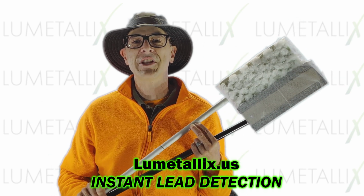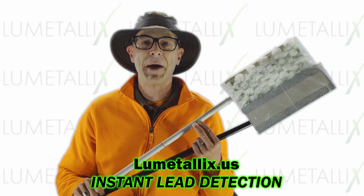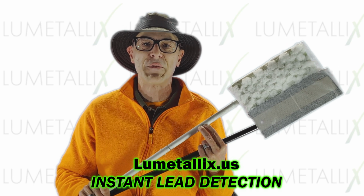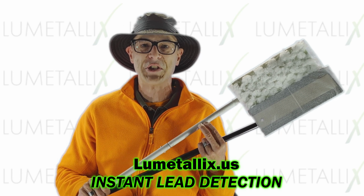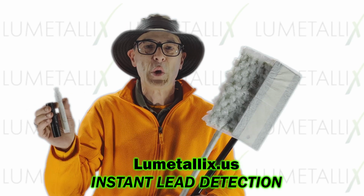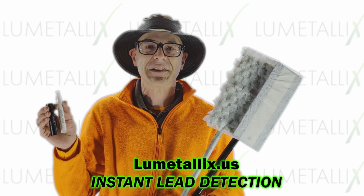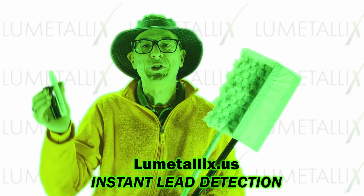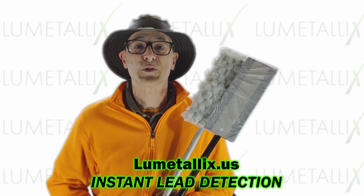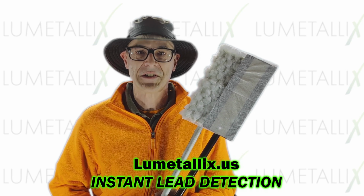Before you clean, wipe down the area you want to test with an electrostatically charged dry mop pad. And after you're done, wipe the area you just cleaned to see if you've done a proper lead-safe cleaning job. Spray the Lumetallix reagent spray in low light, use the UV light, and check to see if there's invisible lead dust. And if it glows green, you know you found lead dust. Never use a dry mop pad for lead-safe cleaning. Dry mop pads are only used for lead-safe testing.